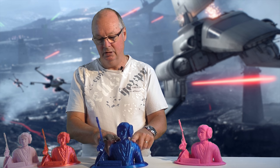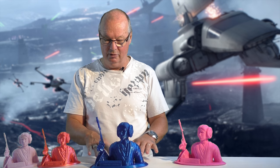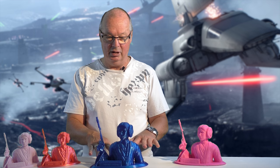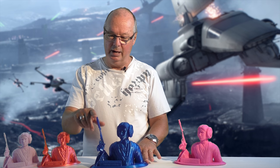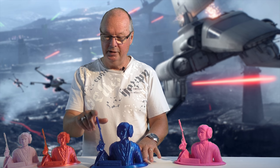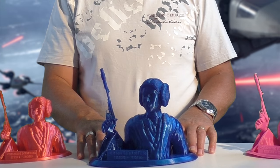But the speed I had to keep an eye on and vary, because there's some places that you can print it a little faster, some places have to be printed a little slower. So it ranged from 10 millimeters per second up to the fastest I could go was about 30 millimeters per second. Once we got up to the top of the gun up here, it was probably printing at about 4 or 5 millimeters per second. And I had to have the fan on to do the end of the gun. So this print all up took 28 hours to print,